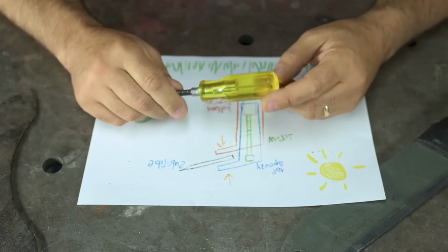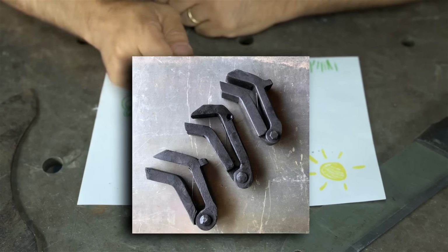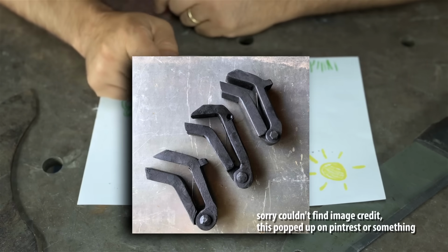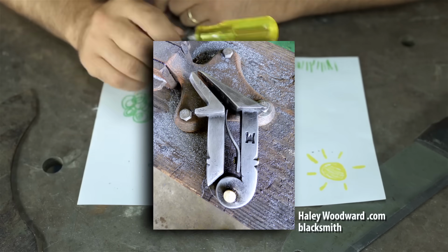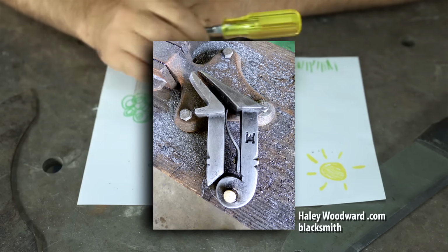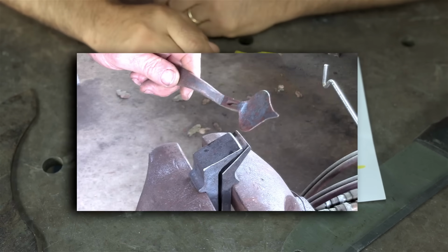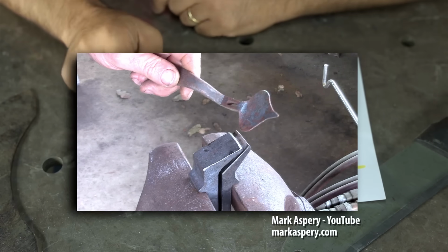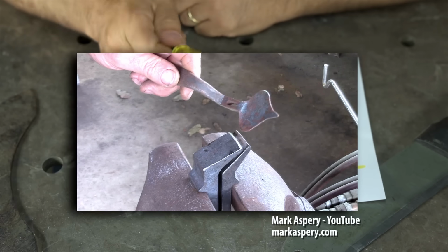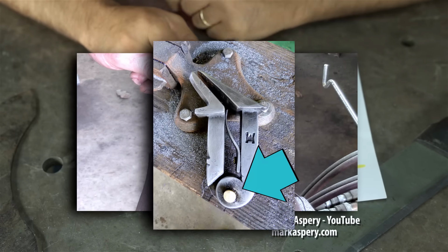Blacksmiths apparently use filing vices, or maybe they used to. I did find these, or variations of these, but none really for sale commercially. Frankly, I didn't look hard because these aren't quite what I'm after, but I bet they're handy. From what I can tell, it looks like these are meant to be used in a bench vise, so you squeeze these in the vise to squeeze the work you need to file, which is clever. I'll give those anvil smackers that. But because they're pinned, like they have a pivot like pliers, the jaw motion won't be parallel.